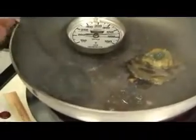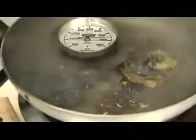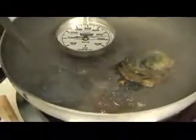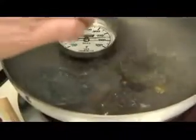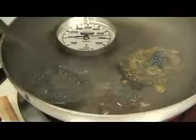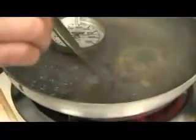If we let this go on, it's just going to continue to get worse and worse here. These two greases, this synthetic grease with a synthetic base oil and this traditional lithium complex grease with the dropping point of 500 degrees, are just going to melt and carbonize, and they're not going to do their job. Whereas the Huskey Tuff Stuff is doing exactly what it should.